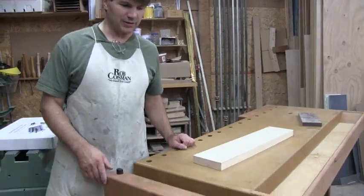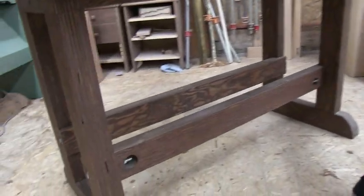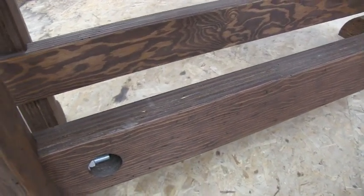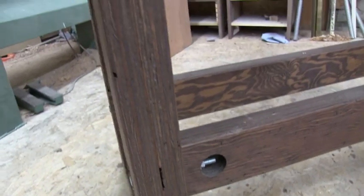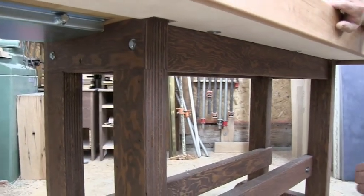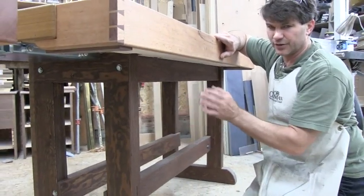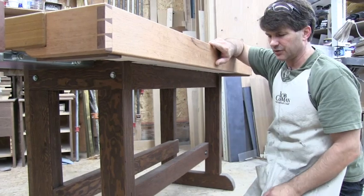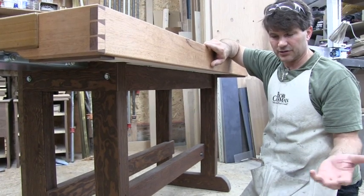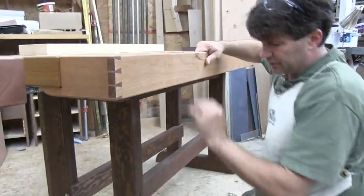The base was the most interesting thing. We built it out of 5/8 inch good-one-side fir plywood. The idea was: how do you glue all these pieces together without having 500 clamps? So we used a staple gun that shoots a quarter-inch crown staple — I think 7/8 or 1 inch long. We took the plywood and cut it into four-inch strips — one sheet cut that way. You can do that with a table saw, circular saw, or even a jigsaw. We put it together very similar to Lego, almost.